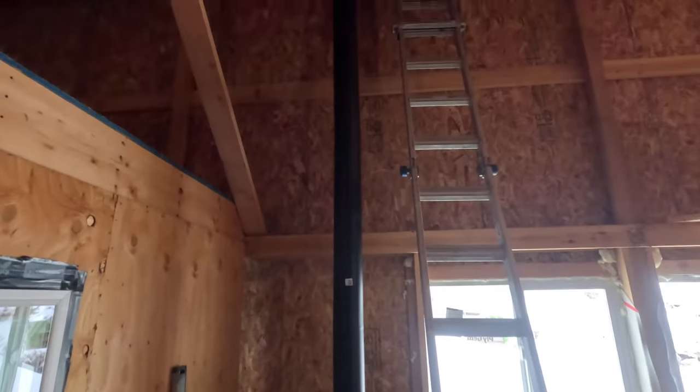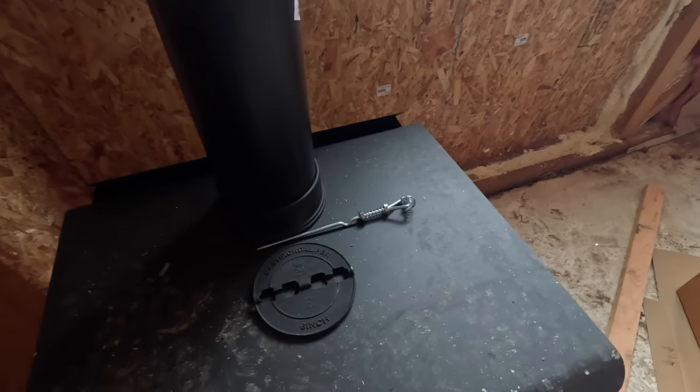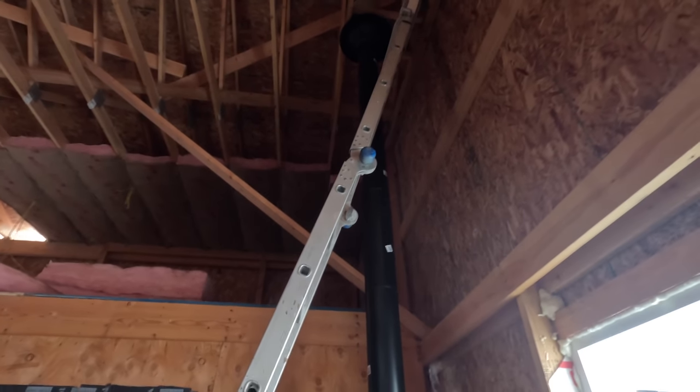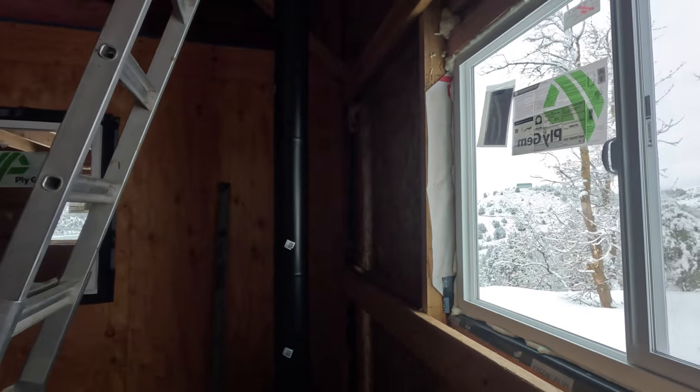Okay, that's all installed to there. And now I'm ready to cut the hole in, put the flashing in, drop the next two tubes in and the rain cap. But I forgot to put in my pipe damper. Needs to go right here. So now I gotta figure out, man, I don't wanna take that whole stack apart, but I'm hoping these screws out, I can probably put a strap around that top pipe and maybe try to ratchet it up into place to just lift everything. I only need to lift it that inch and a half or so to get the flange out of here so that I can slide it over, have my two holes drilled through, put my damper back in and then set it back into place. Dang it. Got in a hurry, got excited, got in a hurry.